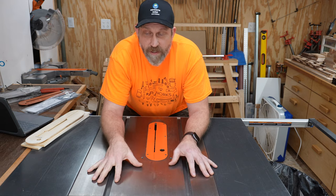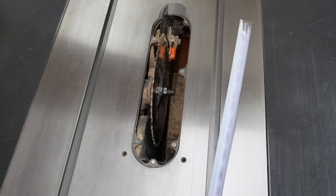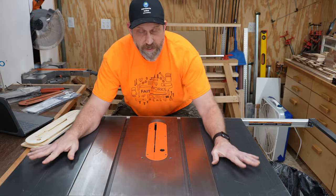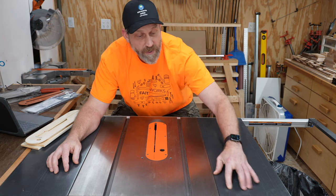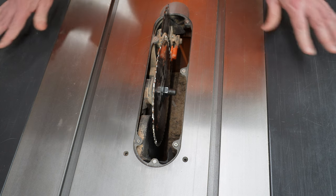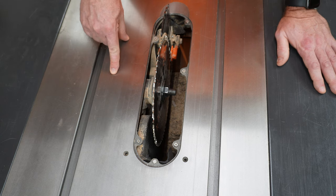The cast iron portion measures about 20 to 20 and a quarter inches from left to right, and 26 and a half inches deep. From the front of the table to the front of the saw blade all the way raised up, we're at 11 and a half inches, and off the back of the saw about six inches, not counting the riving knife. The wings are stamped steel, and that introduces some issues — the edges can be kind of rounded, and the difference in material makes it difficult to line up and get level when assembling. It would be really nice if they would provide cast iron wings as well. Some people replace these wings with plywood, melamine, or MDF.